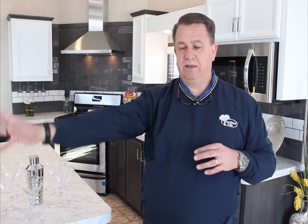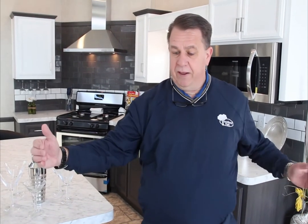One of the features that Woodland Park does that you're not going to find in virtually anybody else's park model is on the sides of the floors we use a double perimeter joist, and that means it's double 2x6s. So your sidewall is actually fully sitting on lumber, 2x6s, and that's a feature that Woodland Park does that we haven't seen anybody else copy.